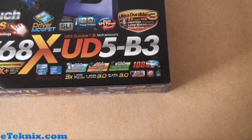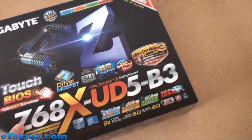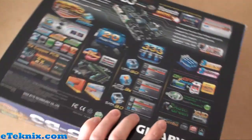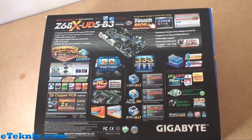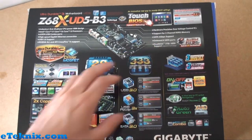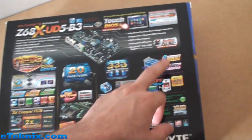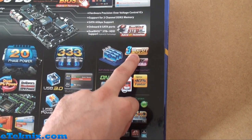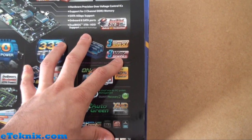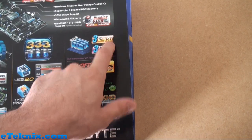Other than that it's the usual sort of 333 — USB 3 and SATA 3. That's pretty much it for the front until the review. Looking at the back it's your usual bits of information — you get a diagram of the board listing some of the main features: the 333 acceleration and 20 phase power. There is an error up here though: it says 3-way SLI but it only supports 2-way SLI. Gigabyte are aware of the issue and they will be changing the design of the box. It has got 3-way graphics with CrossfireX, but for SLI it's only 2-way, hence why you'll see there's only a single SLI bridge included.